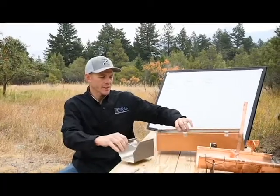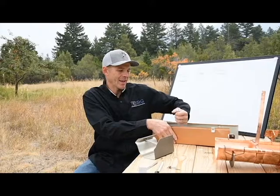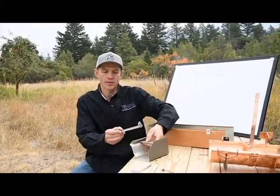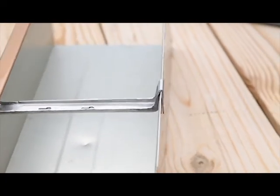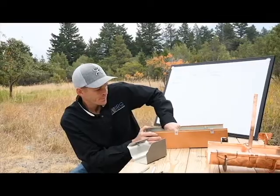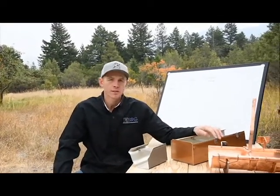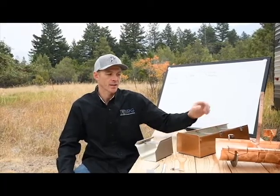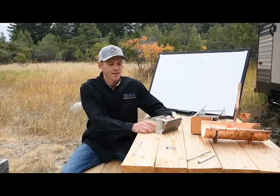The next step up from that is a six-inch gutter version — these are the same hangers, just a little larger. There's a six-inch one, but they make these in five-inch as well. This is what's called the clip version — it's the same hang tight bracket but with a clip that pops over the back of the gutter. The main situation where these are helpful is hanging a longer gutter, as they keep it more sturdy and rigid.